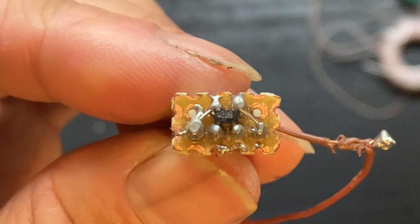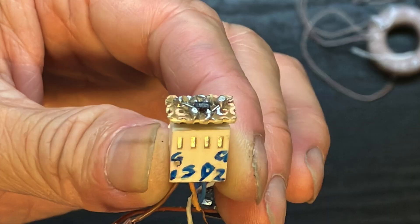For the detector, you can use this MOSFET called 3DQ — the original model number is 3SK143, batch number Q. You can purchase it from an eBay shop of one of the crystal radio hobbyists in the US who got the stock from China. I'll put a link to his eBay shop in the YouTube description. The 3DQ has four pins. I use a four-pin socket to mount it so I can replace faulty ones. Because 3DQ is quite sensitive, it's quite easy to be broken, so it's better to put it in a socket so you can replace it anytime.